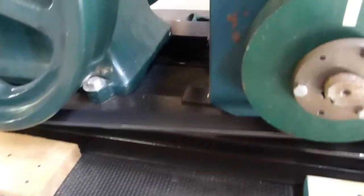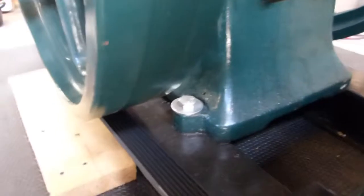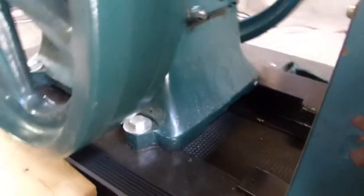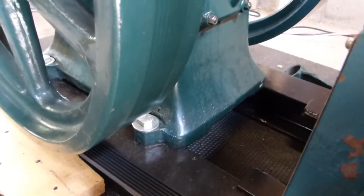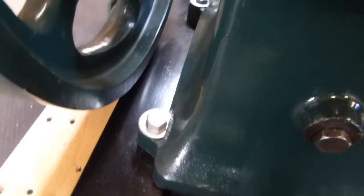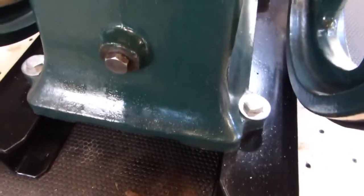I had these 4x4 I-beams cut up, welded them together, painted them all. So the engine bolts to those with 5/8 inch bolts. Everything's nice and lagged down. The casting for this engine frame was actually surprisingly good. I was expecting to have to shim one of these bolts or something to get it to not rock, but for as much stuff on this engine that was out of whack, the bolts and everything in the frame was perfect. No complaints on that.